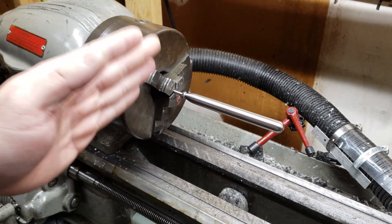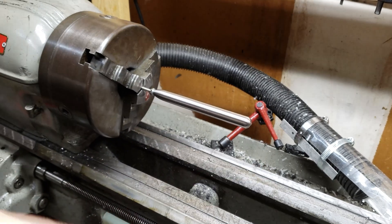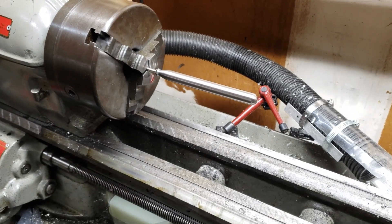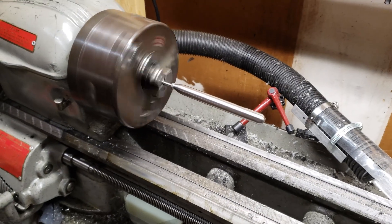The colors go from yellow, bronze, purple, blue, green, white — which is titanium dioxide and not desirable. The secret is to heat the part uniformly by focusing heat on the thicker parts to maintain the heat throughout the whole part.